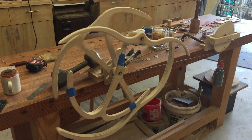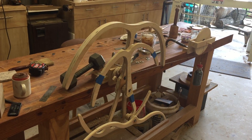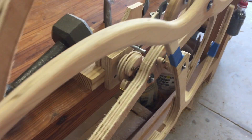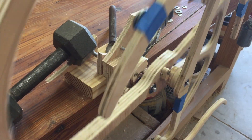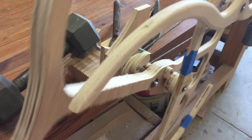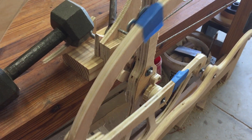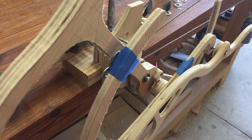Just a short update on my kinetic sculpture. Got it running fairly well. Take a look at the mechanism — I changed it just a little bit. It's a little bit frustrating in that adding a three gram washer five centimeters off the axis will completely change how the whole system works. I spent hours balancing it, trying to get a nice random looking motion out of it.